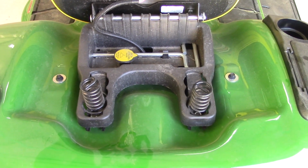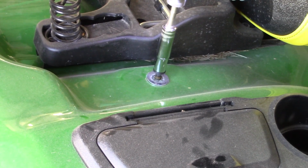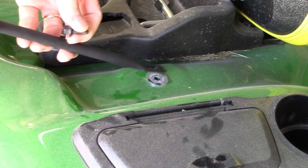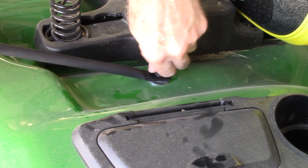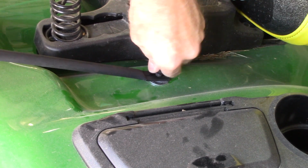Next, we added the two side braces, which in this application get attached at these 2 points under the seat. Just remove the two 10mm bolts already in place and use them to secure the low angle ends of the braces.